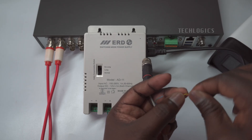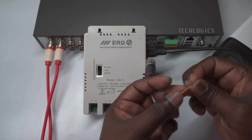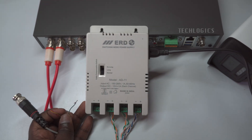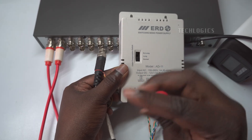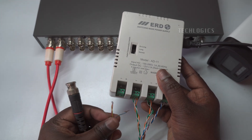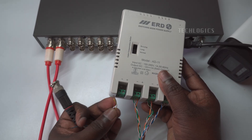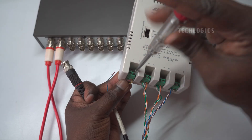At the DVR side of the 3+1 cable, prepare the three wires to connect to the SMPS. You can use any combination for the color codes, but ensure that both ends of the cable match the positive and negative polarity correctly. I have used a two-color combination for the positive power supply on the three wires. By using two wires for the positive connection, the voltage will be sufficient to reach the camera. The remaining single wire is used as the negative connection. Always ensure that the polarity is correct — for example, the red and yellow wires are used for positive while the blue wire is for negative.